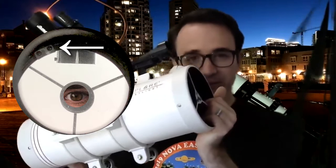To show you how to do that, I threw this out of collimation and I am going to show you how to fix it. It's not as easy as I thought it would be. This telescope cannot be collimated the traditional way very easily, because even if I remove this focal extender, I can't get my eye close enough to the telescope to see the mirror clips on the primary mirror.